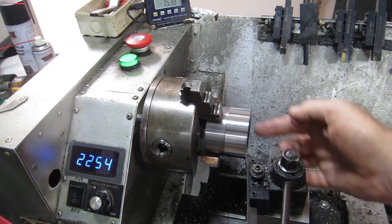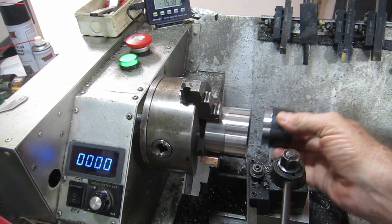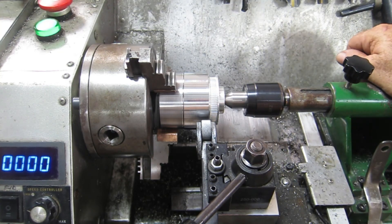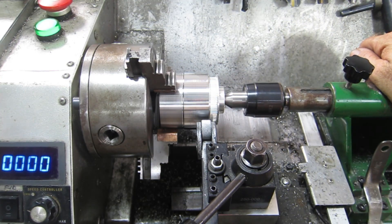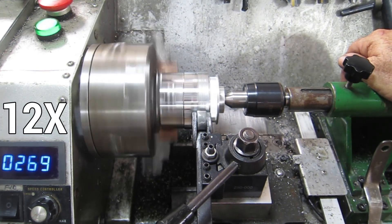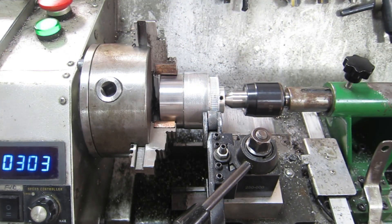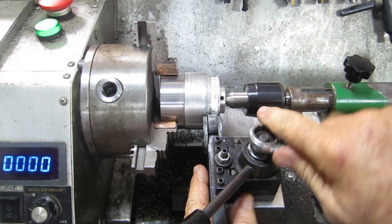I don't think I'll bore you with the boring - I'll clean that up. What I'm thinking is when I go to knurl this, if I can get the center into the back of this and stick it inside there, that'll help support it while I'm trying to knurl it. I had a bit of a change of mind about boring that out enough to fit that other piece up in there, but it would take way too much out, so I think I'll turn the other end down to fit inside there. This motor certainly doesn't like being loaded up at low speeds, and that tool looks a bit cockeyed to me, so I'm going to square it up.